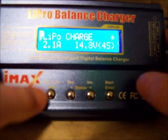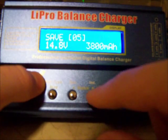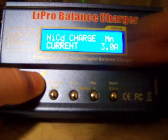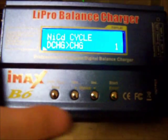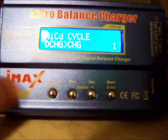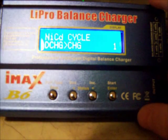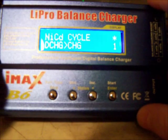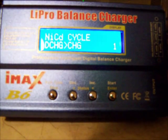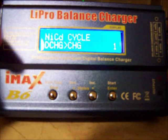Basically it's the same for anything else. You press enter and we'll go over to NiMH or NiCAD — it'll go into current, then discharge, and that's it. This charger itself also does cycles. Basically what cycling is: when you get a new battery, you need to put it through cycles — meaning charge it, discharge it, charge it, discharge it. What your hobby shop would say a year or two ago is you need to charge it, put it in your truck, run it completely dead, and charge again — probably 10 or 15 times. That gets real boring — trust me, I did that with my Slash and absolutely hated it. You can't go full throttle; you're breaking in that battery. This charger does it for you.